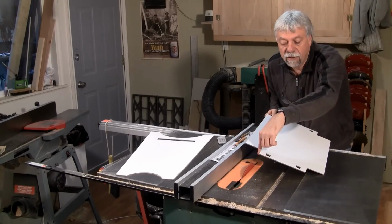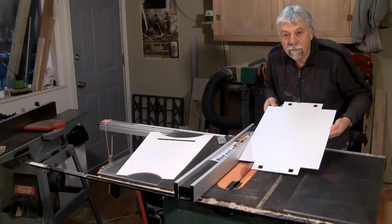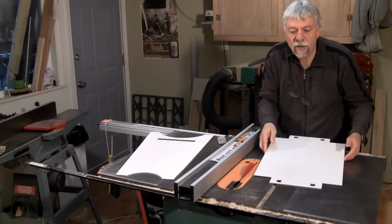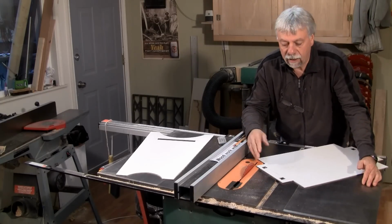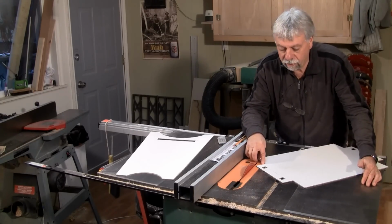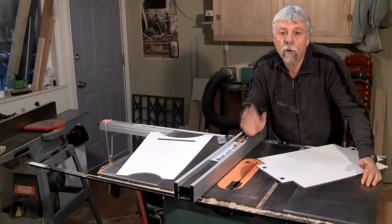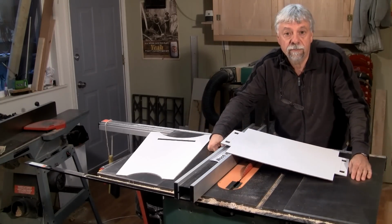And this is 8 inches in here, and then you can do the same thing here, flip it over, and the same on the other side. And then you just clean it up with a little hand saw, or you could use a chisel just to sort of clean up the edges and get the little end to drop out. So that's a real quick way of being able to make both of these templates.